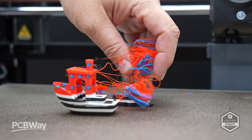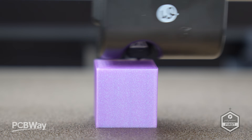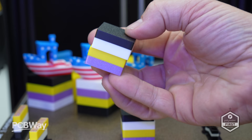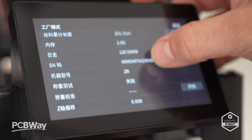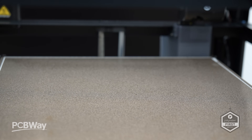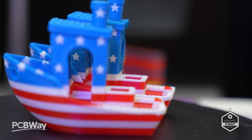Over the years I've seen plenty of stress points with new launches — damaged printers, different filament behaviour, and even quirky issues like moisture affecting prints. Factory test prints are one thing, but once it's on your desk at home the reality can be very different. For example, in some of my early prints I had layer shift issues, which was resolved by adjusting the bed through a hidden menu. After that I focused on print quality and dimensional accuracy, dialling in the pressure advance and other settings. On this Benchy test I was able to see strong improvements across the prints, showing that with a bit of tuning the machine really does start to shine.